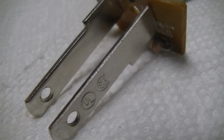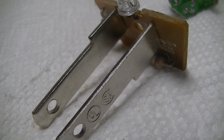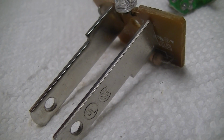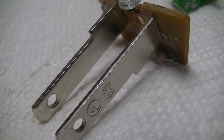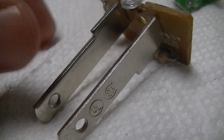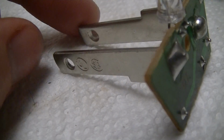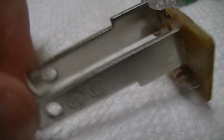Although, needless to say, I'm not going to be getting rid of that scope, because due to crappily implemented in a good way, gain roll-off in the front end, combined with a very high sampling rate for its bandwidth, it's useful up to well into the hundreds of megacycles for qualitative measurements, if nothing else. So yeah,